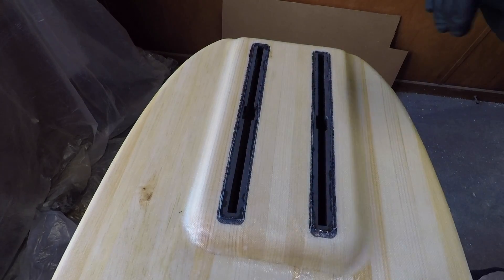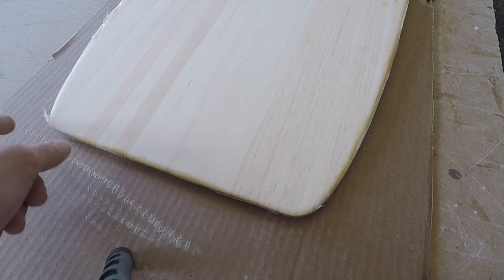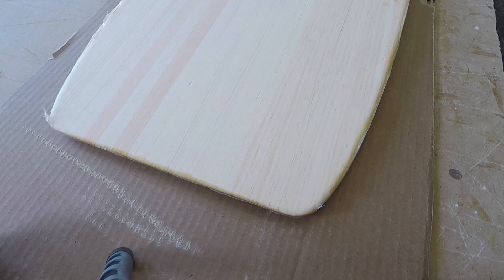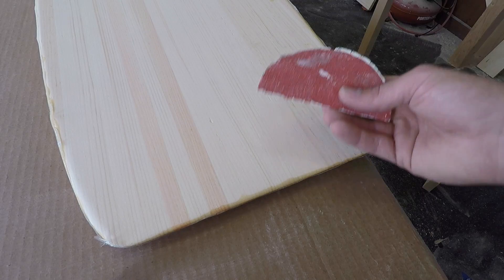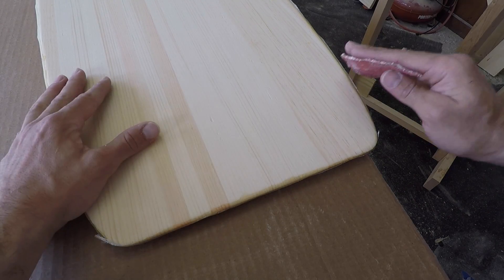That top side is completely cured up. I just went ahead with the razor knife and gave the glass a quick trim, and now there are some slight edges here so I'm just going to take some sandpaper and sand those down to make everything smooth, and then it's going to be time to glass this top side. Very easy to do — I believe this is 80 grit — just kind of get in there.